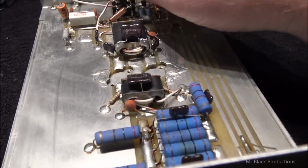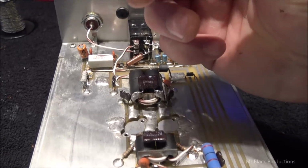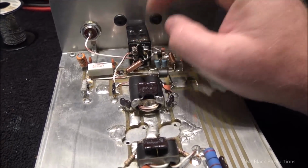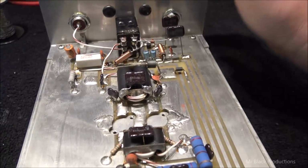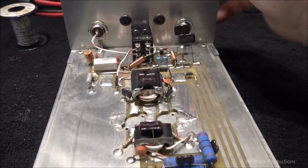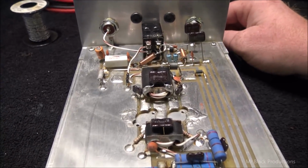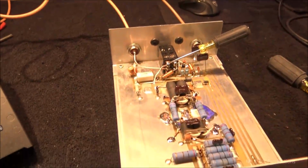And we're going to go ahead and play with the output tune, or the pass-through tune, a little bit. See if we can figure out what value capacitor they had in here. I mean, in most situations that's more than appropriate, where it's just shorted directly across with a direct coupling to ground, but I want to see what it looks like across the whole spectrum from 0 through 30 megahertz and not just at some mono-banded frequency, if that makes any sense. So we shall return. See if I can get through this and not have the phone ring.